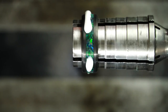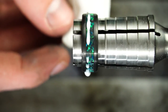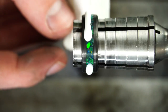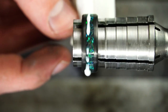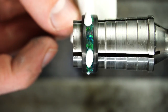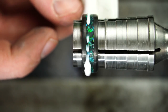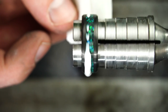So let's say I polish this for about 30 seconds to get the desired effect. I'd recommend spending about 3 times that amount if you're doing metal. If I do 30 seconds here, it's gonna look fantastic. That's probably even a little bit overkill. I'd recommend doing 1 minute and 30 seconds if you wanna get that same level of perfection with metal. So carbon fiber goes a lot easier. I could honestly probably do this in 5 seconds with the lathe turned to max and it'd be pretty good, but you might as well be thorough. It doesn't take too long.